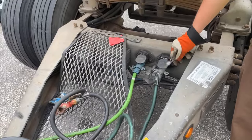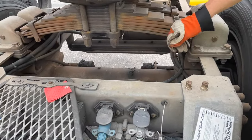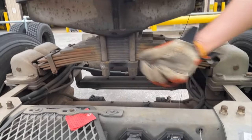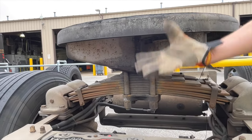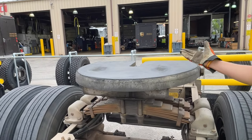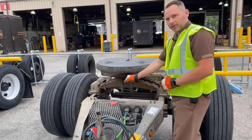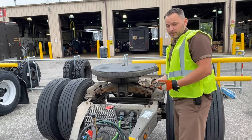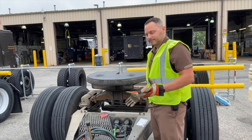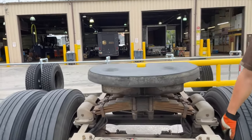Now as we continue, we want to release our air. Well, the cable is actually snapped, so we can't release our air the way we should. Our handle, we always want to check and make sure this is set in the open position. Well, it's not here, it completely fell out. So we go to hook this up and we never pay attention to that handle. Well, now how are we going to check and make sure it's all the way over? Or if for some reason we don't check that, because out of sight, out of mind, now how are you going to unhook it?